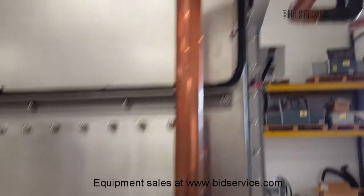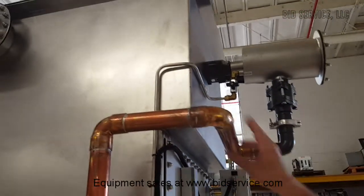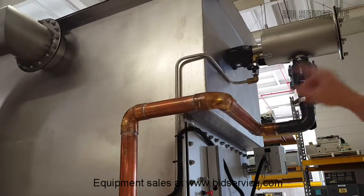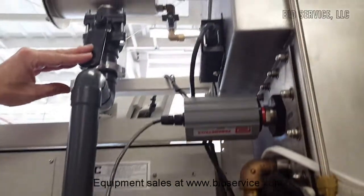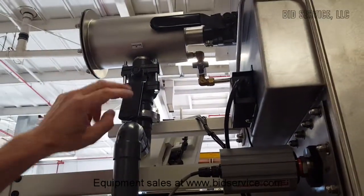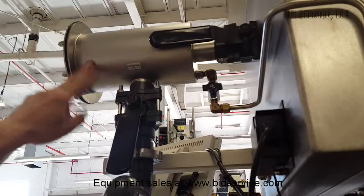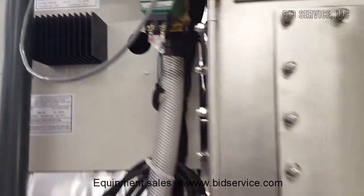Coming around here, this is where we'll bring the nitrogen from the box through the purifier. You have this line here, there's a filter inside, and a couple of ball valves. The flow is in this direction through the purifier. Then we go back to this other side — once it goes through the purifier it enters back into the glove box through this port here. You have two ball valves to isolate it if you need to do any work. There's a filter here, a purge valve right here, and when you do the purge vent it'll come out through this valve and exhaust here.